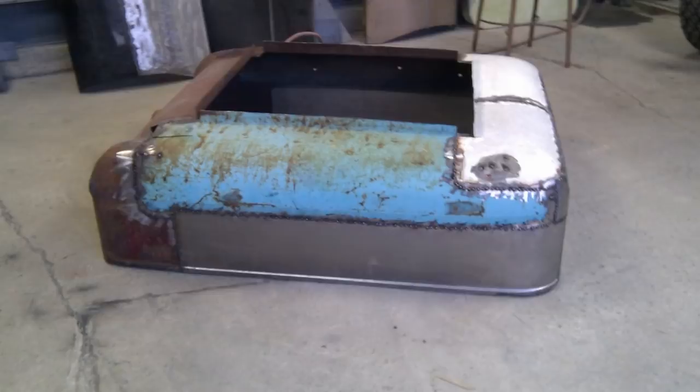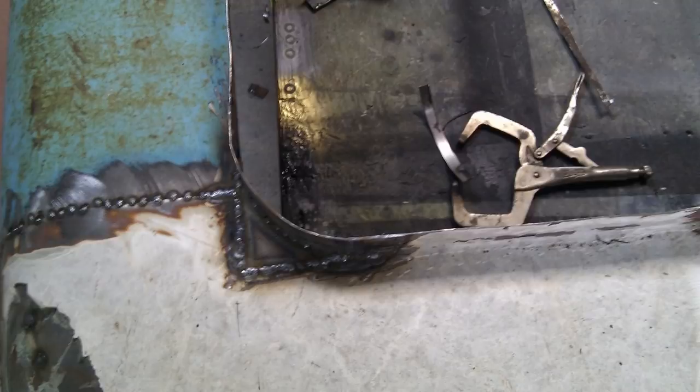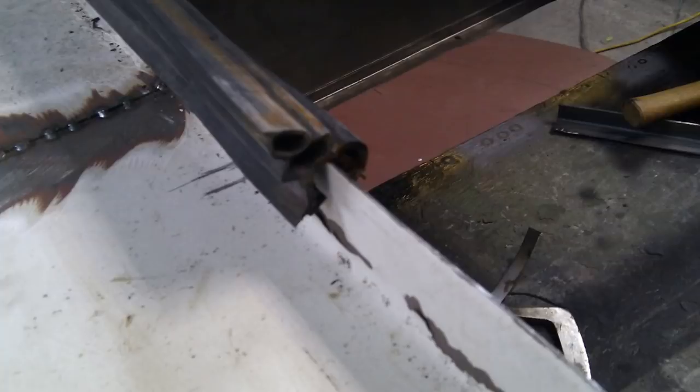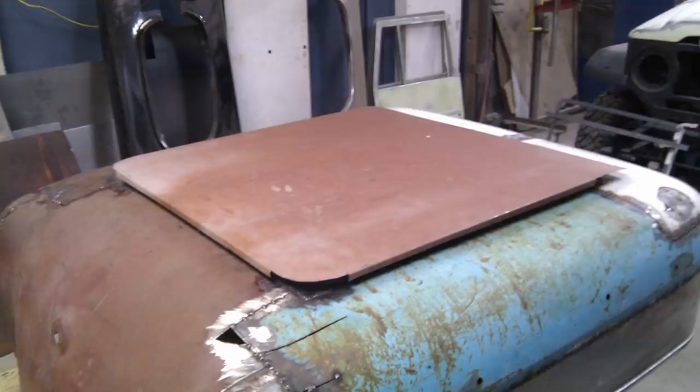Keep in mind this was just a little project I was banging together — nothing for a customer, just having a bit of fun with it in the evenings. One of the issues you'll have any time you build a little trailer is trying to find a way to keep it watertight. All I went and did was raise up the lip all the way around the opening one inch by bending over the metal on a 90-degree bend. Then I made up little corners out of pieces of steel, welded them in place, and used a trunk seal off a scrap Taurus wagon — ran that all the way around. That's what the actual hatch seals on.